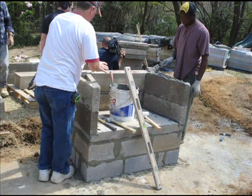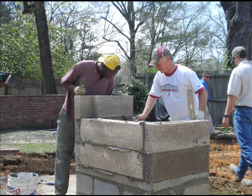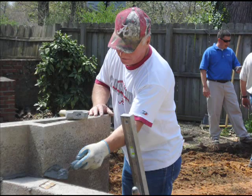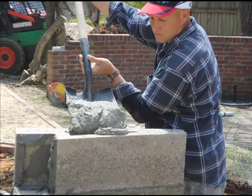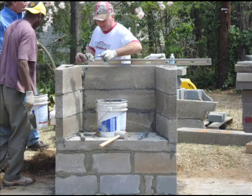These 3 shots show the mason using the mortar to the extent necessary for it to ooze out between the blocks. This ooze is then wiped with a trowel to assure a leak-free seal. The mason's choice is whether to core fill the side block or not. In this particular case, the choice was made to core fill because it was a freestanding fireplace out in the yard. Here you can see the mason checking progress so far by plumbing and leveling.